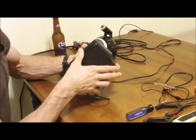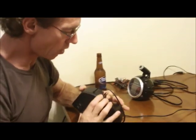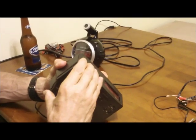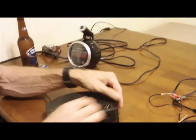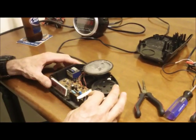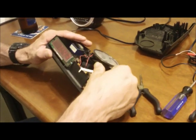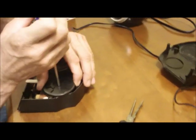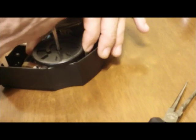I've already taken the screws out of this, so hopefully it should come apart. Yes, it is plugged into the wall, and I will caution you that you should know a little bit about electronics before you do this — you don't want to get zapped. I'm leaving the speaker hooked up just so that I know the radio is on. Now what I like to do with these types of projects is dismantle it so that I have direct access to the tuning capacitor.